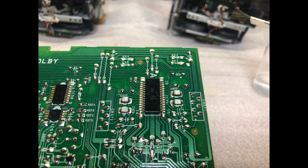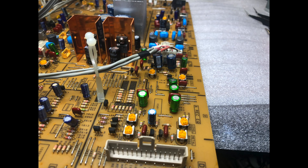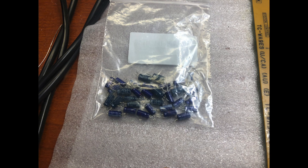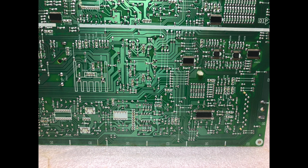From the back side you may see the control chips which are responsible for Dolby B and C, and for switching connections between input and output circuits. You may see the installed capacitors for the recording and playback amplifiers. A full set of all old capacitors has been saved for reference.